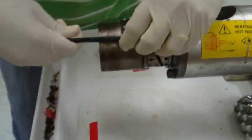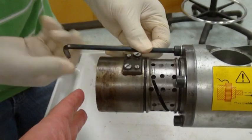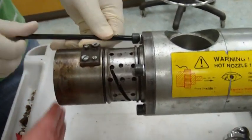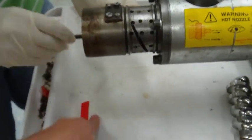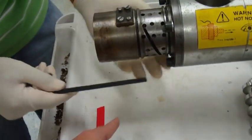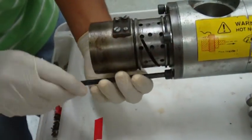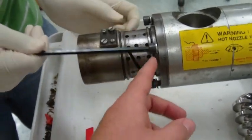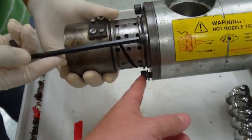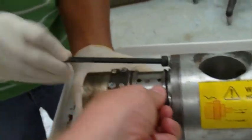Now, you see how I have this scooted way back, right? So when we assemble it, or when we clean it, or disassemble it, we want this to not protrude past like this red line right here. Because that way if it falls, it's just going to hit this here. It still shouldn't fall that far, but we have to be very careful. And what you do is you have four different Allen bolts here to remove, and let's leave that one right there, and remove all the other three first, so this one's always on, right? Does that make sense, sir? So it goes last, and so we have our hand ready to go when it's ready to go, right?